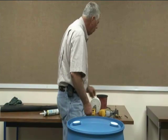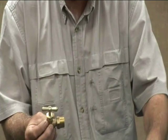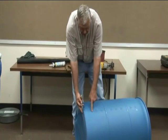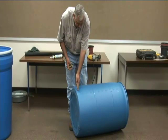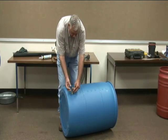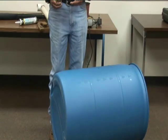Thirdly, we are going to connect a faucet close to the bottom. We are using a three-quarter-inch faucet with male threads — I like brass faucets because the threads help cut through the PVC. We'll use a 15/16-inch paddle bit and cut that hole closer to the bottom, but not at the very bottom, so water remains to hold it in place in high winds, sediment stays below the faucet, and we can turn the faucet sideways so a hose doesn't kink.